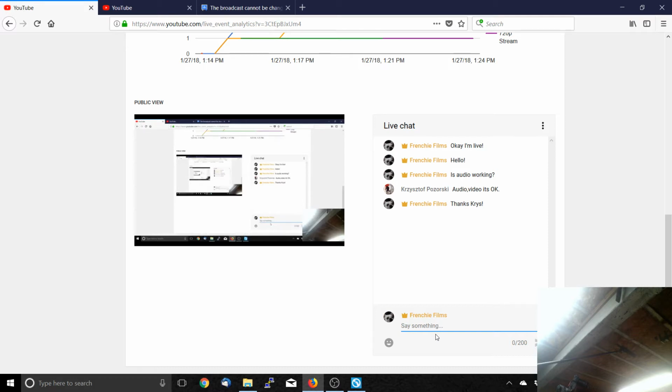But so this is coming in the nanofarad range. I had to adjust that to be in the, oops, that's not what I want to do. Range, microfarad. That's nanofarad. Okay, so there's my microfarad range. And it says 0.05. That's what I want. So this is the first one, 0.05.